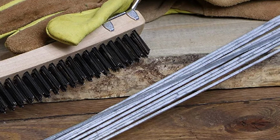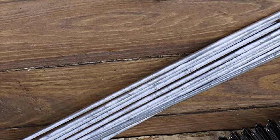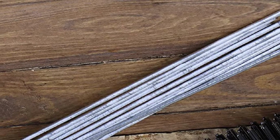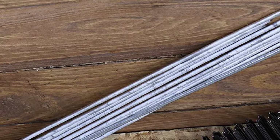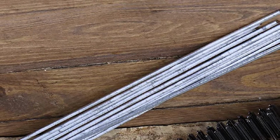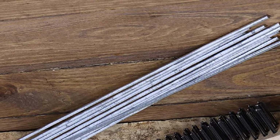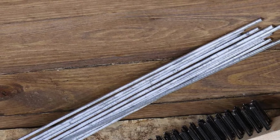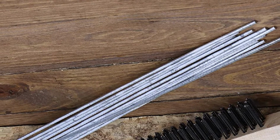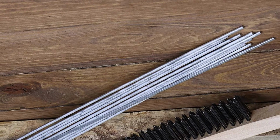What I love about these rods is their resistance. A lot of high-quality rods can never withstand high temperatures, and they denature because of it. This restricts them from performing low-level welding. With the Alumaloy, you can do whatever type of welding. You can repair the thickest and the thinnest metal, as the Alumaloy melts at 728 degrees Fahrenheit. You can fix a pot metal, which is one of the most challenging metals to repair.